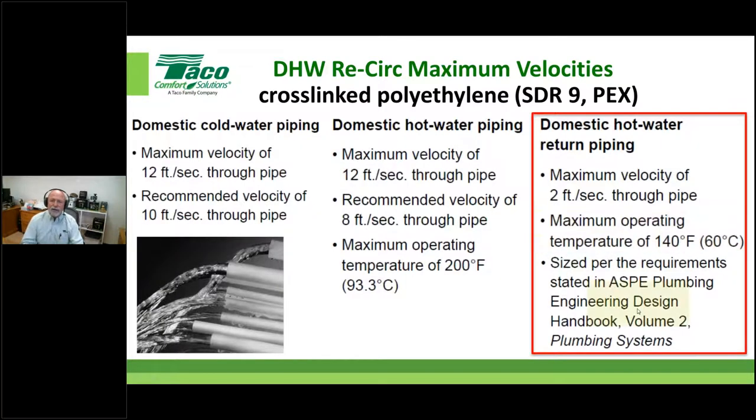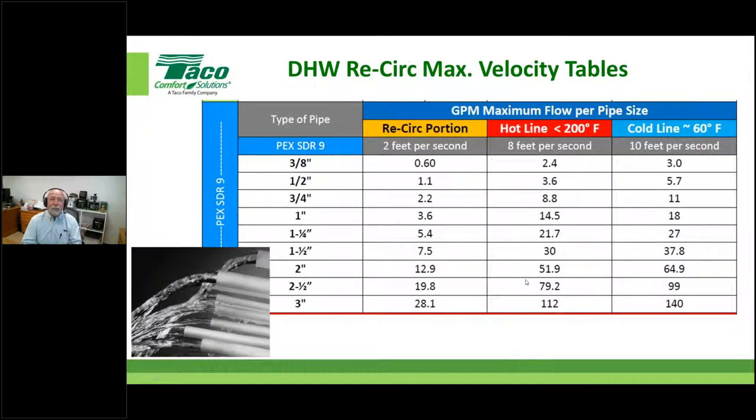They've pretty much settled on this in the ASPE Plumbing Engineer Design Handbook, Volume 2, Plumbing Systems. So this is pointed out in there, that this 2 feet per second is kind of a safe measure. We gotta recommend that. The good thing about that is it gives us some place to start that's safe. We don't have to worry about exceeding it and doing the damage that we talked about